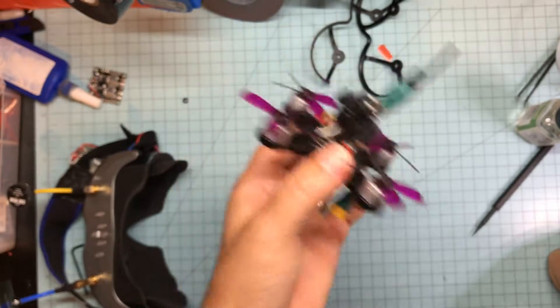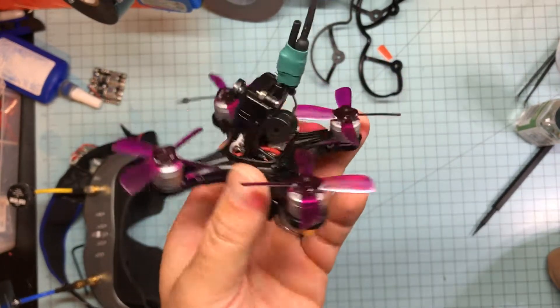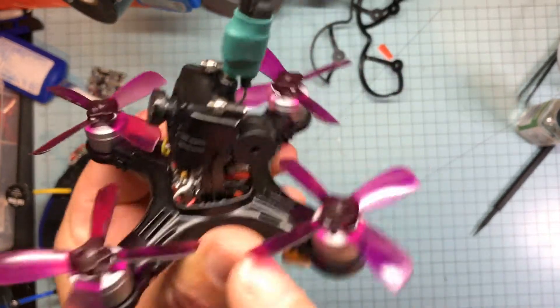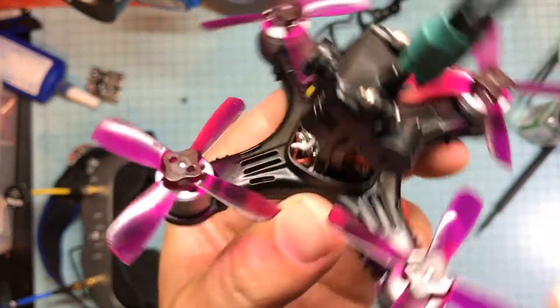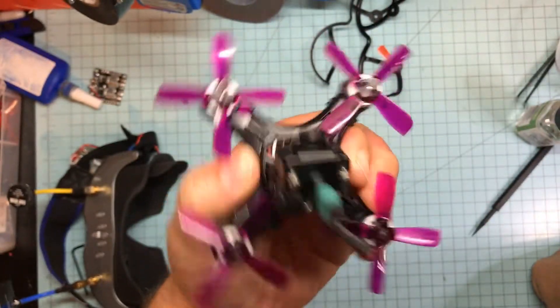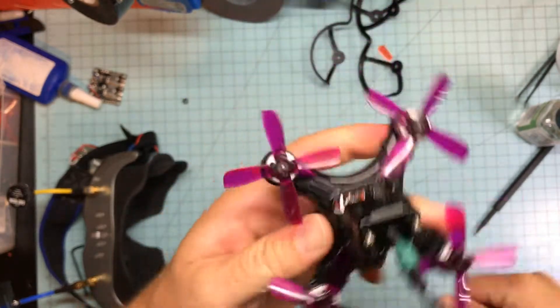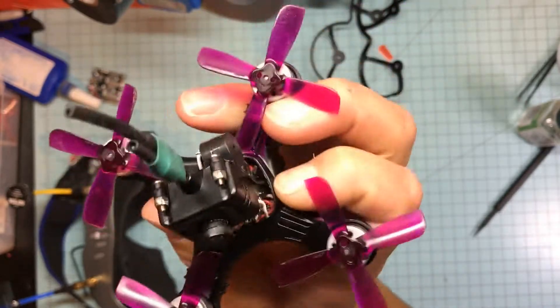These props — way better. As soon as I put them on: no jello, no issues. The other issue I had — and some people might have this — when you pull the flight controller out to flip it over to solder your beeper, mine was just barely touching the frame inside. I was getting this twitching oscillation when I hovered: it would cock to the right and yaw by itself.